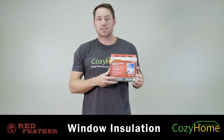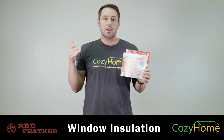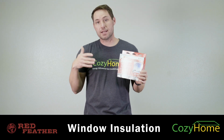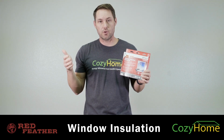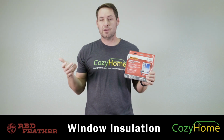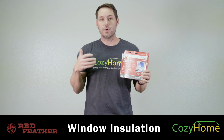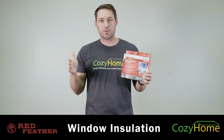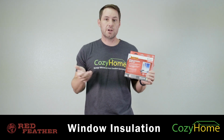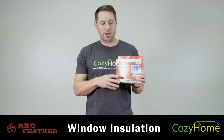This right here is a window insulating kit. What these do is create an extra air barrier in between your home and your window, which will help cut down on the amount of heat that escapes through your windows. Windows are pretty big energy leaks in homes, especially if you have single pane windows. They can leak a lot of air through them, but also heat transfer through conduction as well. So this basically will turn a single pane window into a double pane window, or a double pane window into a triple pane window.